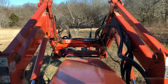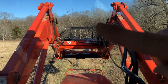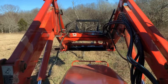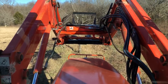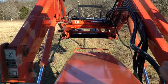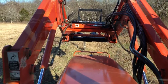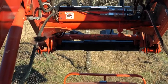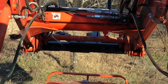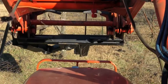This is the MTL and you can see the push bar right across here, and I use that a lot. A lot of times I'll start with the loader up high like it is now because I can see that stationary jaw right there. So if I come in on that tree a little bit high and I see it go inside that jaw, then I can drop it down and I know I'm pretty much where I need to be. On smaller trees, or a lot of times with a level like that, you can't really see - you can angle it up to get some visibility, or curl it down to see where you're at, and then come into the tree and drop it.